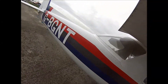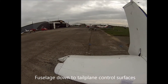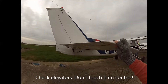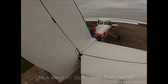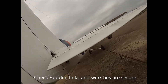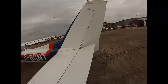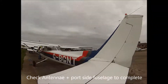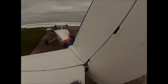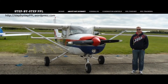The fuel is good. Going down the fuselage. Moving to the tail plane — it's all good. Just the trim, never touch this. Check the rudder mechanism, the tie pins here, this is all good. On the other side of the tail plane — that's all good. The tail plane is good.